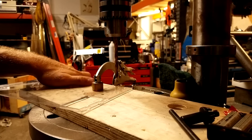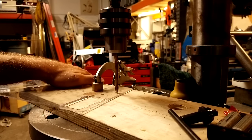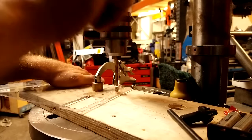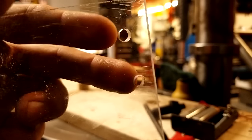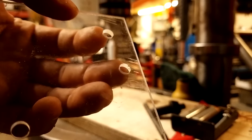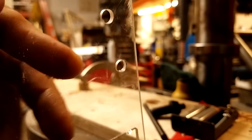Let's drill another hole. Even though we know this drill bit works great, we're going to use dish soap too. The overall finish of the hole is finer than the first one, and the chips are cleaner and less burnt. Especially if you have an issue with edges burring up from heat, the dish soap goes a long way to making the hole better to drill.